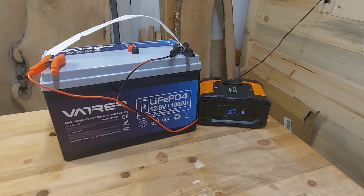When I first looked at heated batteries, I thought — if it's got a heater that the battery runs, wouldn't that drain the battery itself? The answer is no. The heater in this Vatrer battery only comes on when it's on a charger, and it needs about 10 amps of charge, which isn't very much — only about 120 watts. So as long as you're getting 100 to 150 watts coming into the battery to charge it, if these batteries drop below 32 degrees they kick on a heater, using that charging power to bring the batteries up to about 42 degrees, then allow them to begin taking a charge.